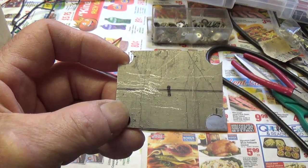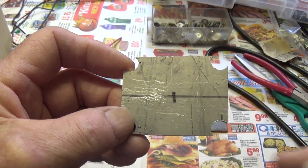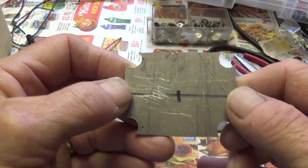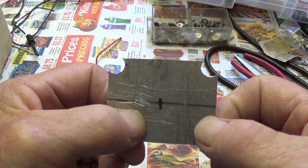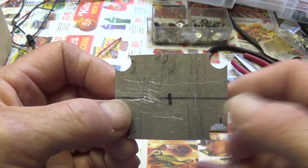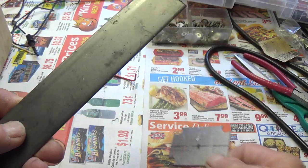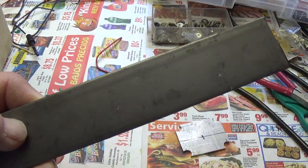Aluminum forms a good portion of the circuit in the amp and provides good conductivity. On the downside, it's very difficult to bend — especially sharply — without a great deal of heat. You almost always end up with fractures. You can't solder to it, so you have to bolt on your ground lugs. Also, it doesn't shield against electromagnetic radiation as well as steel does. However, you can polish it to look a whole lot better than steel, and it won't rust. Whereas steel, over time, is going to show fingerprints, and if it's exposed to moisture, it will start to rust.